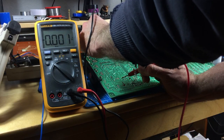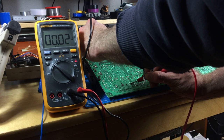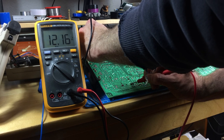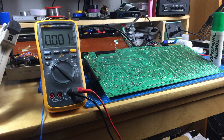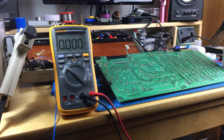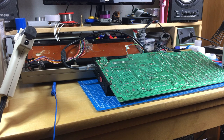Let's check the actual voltages. Let's check the ground. That's 5 volts. This should be 12 volts - and we're pretty much spot on, of course, obviously. Otherwise the Commodore 64 wouldn't work or produce a picture, which it does. All hunky-dory it seems! That was kind of easy. Let's put it back together and see if the SID sounds nicely and stuff like that.